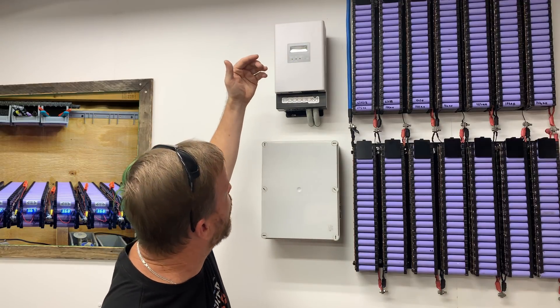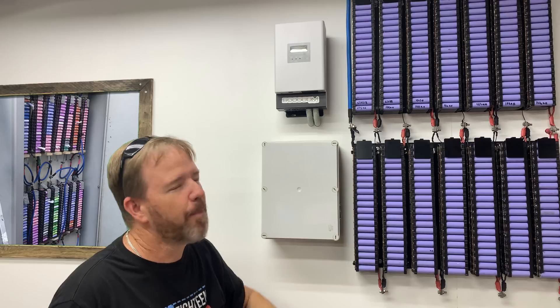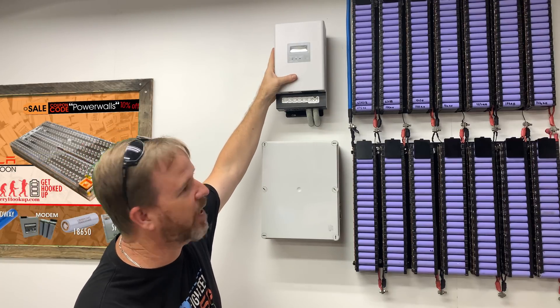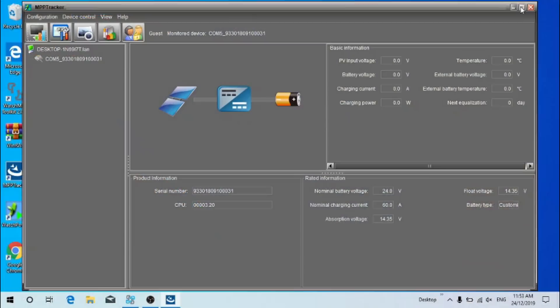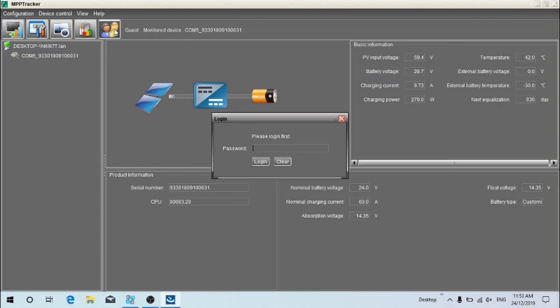For me to complete this test, I'm going to have to change a few settings. At the moment I've got the PCM60X charge controller charging the batteries, but it's only set to 4.1 volts per cell. So I'm going to have to change the Watchmon 7 to 4.2 volts top of charge, and similarly the PCM60X to 29.4 volts. I'll plug the RJ45 cable in, and while that's opening up, plug the USB into the computer. We're already on COM port 5, so we'll log in — password is administrator.